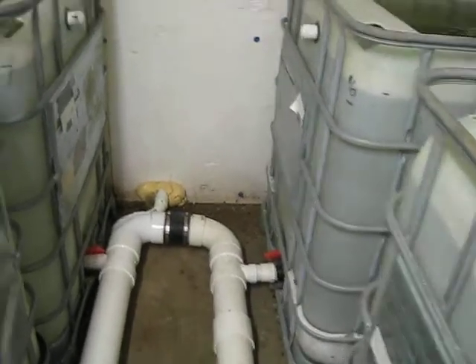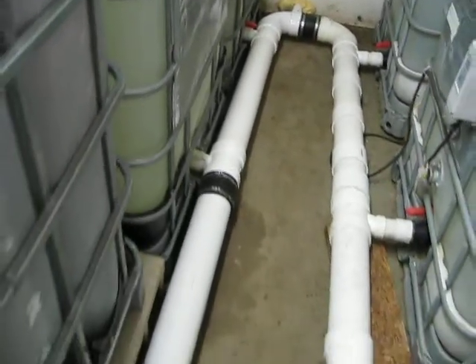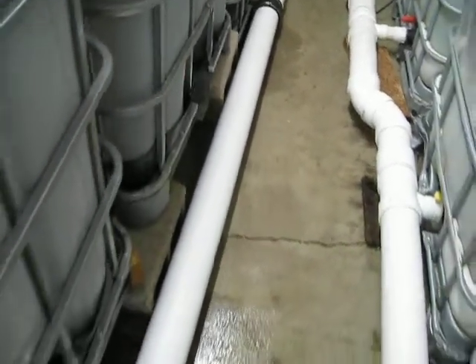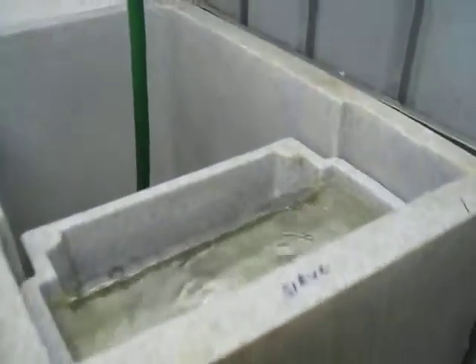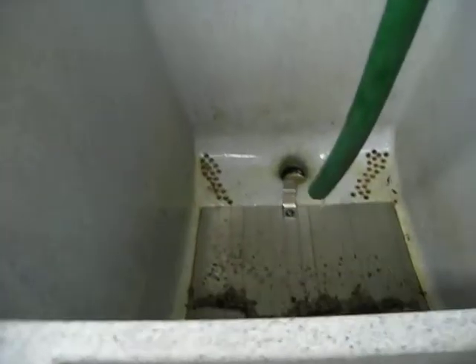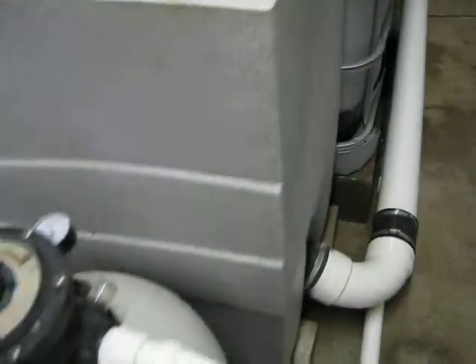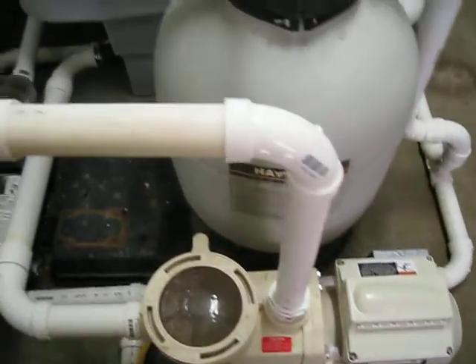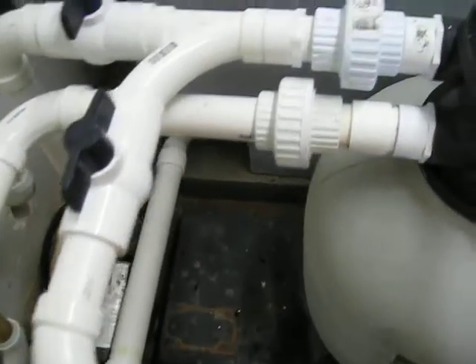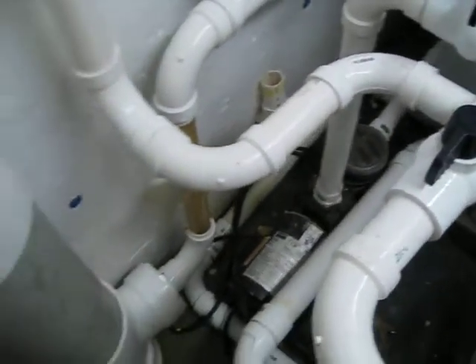The line makes a U-turn at the wall and comes back up through the last two tanks, up past the biofilters, into the sieve, up and over the dam, down through the stream, and into the sump. The pump sucks the water out of the sump, up through the filter, out of the filter, and into a new piece we made here — it's actually an oxygen injector.